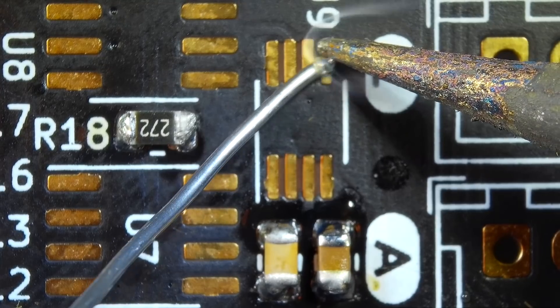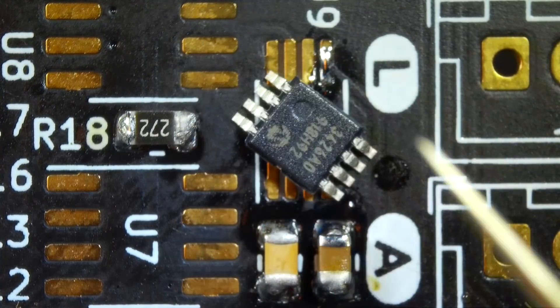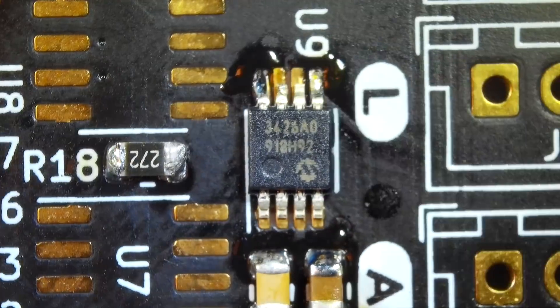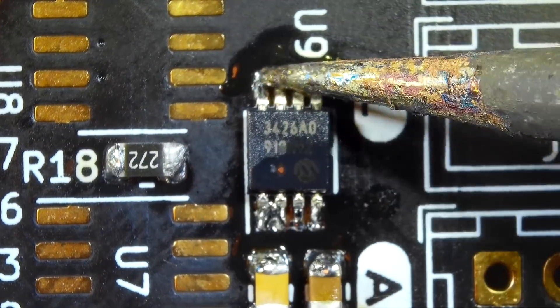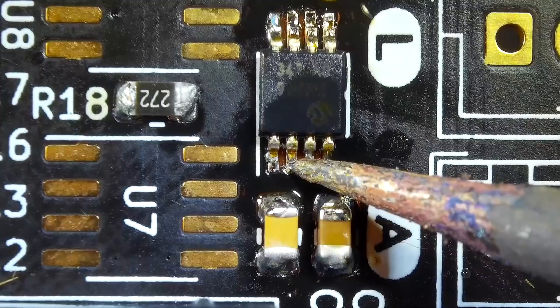For the vacuum sensor, we had previously connected to the ADC pins directly, but Marlin doesn't handle analog reads very well — there are some timing constraints on the software side of things. So in order to increase the frequency at which we can probe the vacuum sensor, we picked a dedicated ADC chip so we can handle it properly.